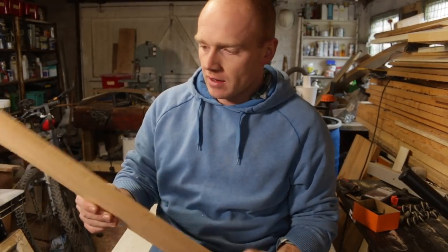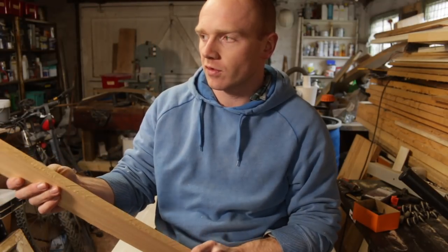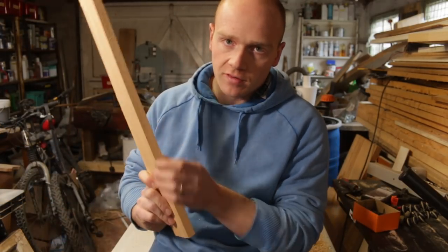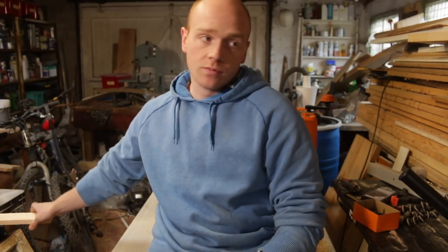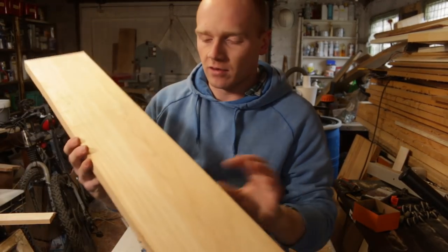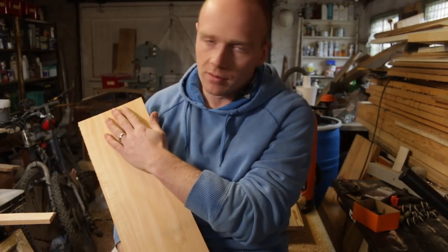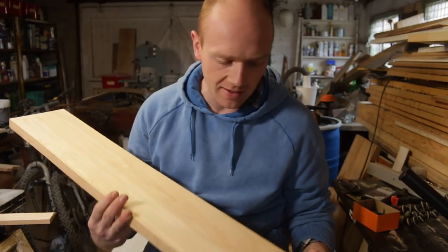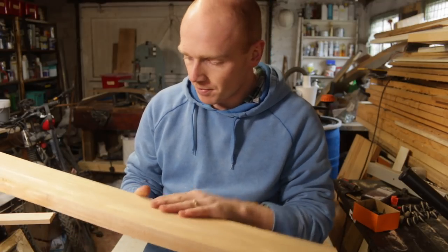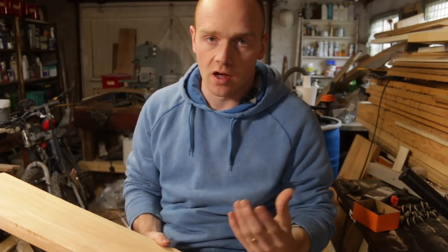That's gone okay. I've got some strips of 18mm — about three-quarter inch stock — and all I'm using so far is just offcuts from around the workshop. The thinner stuff I've taken down to 18mm, and most of the boards are quite thick so I've taken those down to 25mm. The first board that goes through gets a bit of snipe so I'm obviously going to leave things long. There's going to be some sanding, and it would probably be worth changing the knives in the planer at some point, but this first batch is all for the internal carcassing.